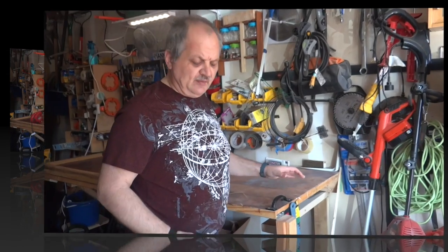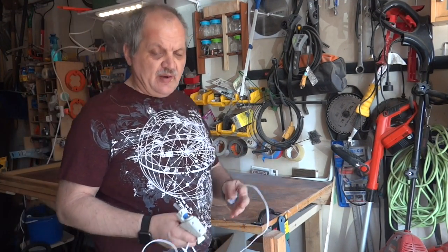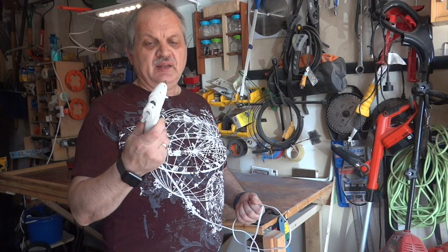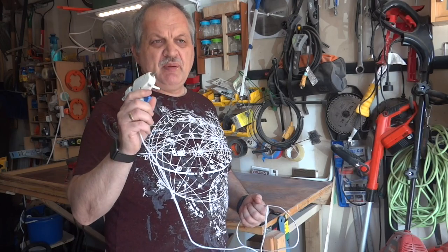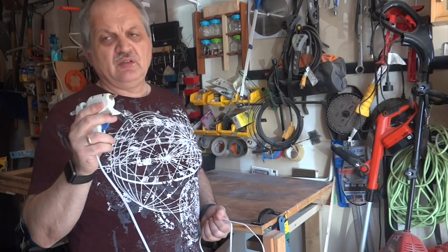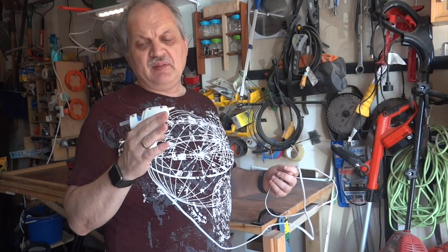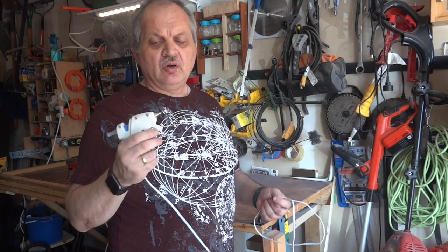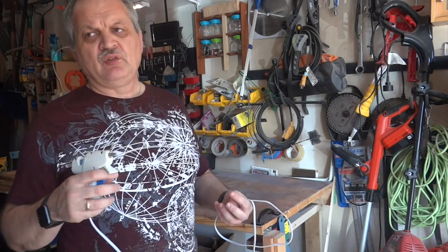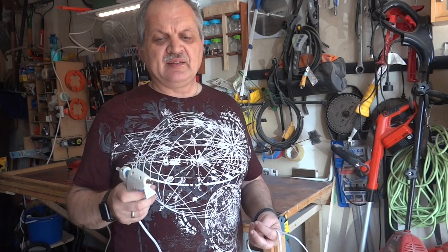As you can see, the bench is coming along, and the first item I want to mention, which probably comes out of a craft shop versus a woodworker shop but is extremely useful, is a glue gun. It doesn't have to be big, but it is a very useful tool. First of all, you can use it to temporarily hold boards together if you want to cut them exactly the same on the bandsaw, for example, or you can use dabs of glue to create little feet for your projects to protect from scratching finished wood and other areas.